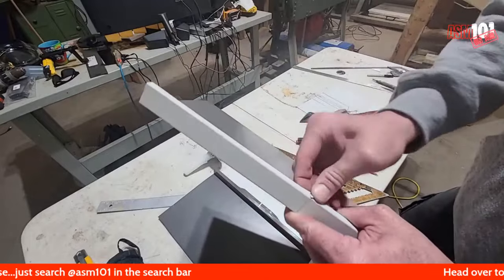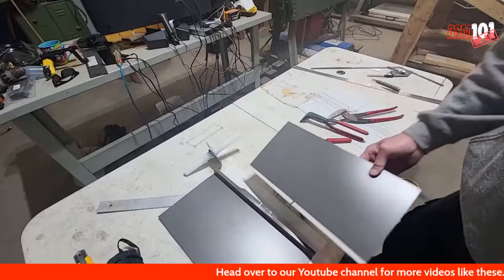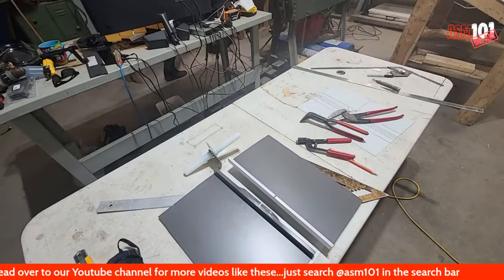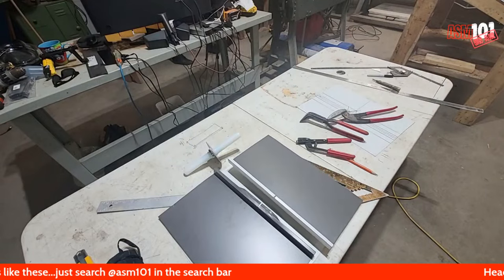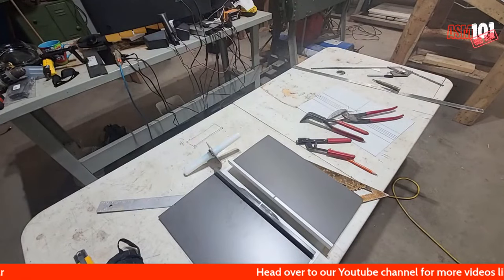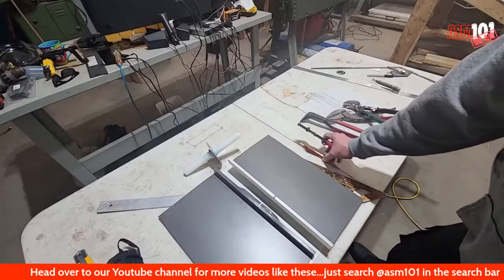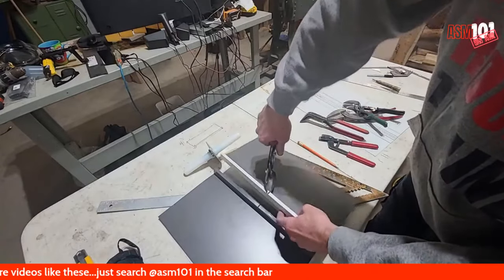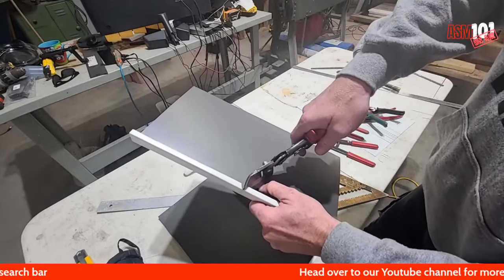If someone was asking me about these notchers, they're starting to get dull. Not really over the moon about them. Instead of that, you can always just pick up your snips and just notch them. Nothing wrong with doing that. It's a slick tool, but it's getting dull. But yeah, you just snip these. Not everyone's going to have those notchers.